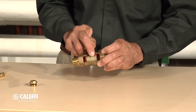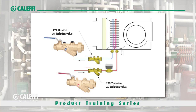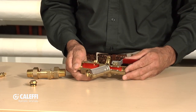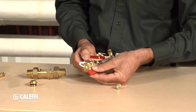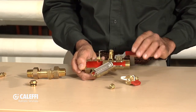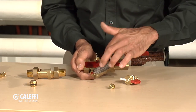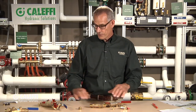When installing this type of valve, because of the small tolerances involved, you want to keep debris out. We offer a brass Y-strainer with an isolation valve so it can be serviced. Flow comes in, goes through the center of the basket, trapping debris before it reaches your valve mechanism downstream. There's a port at the bottom with a hose connection to flush it out. The strainer is removable — take the plug out and remove the strainer if it gets plugged. The top also has PT ports so you can check for pressure differential indicating the strainer needs service.